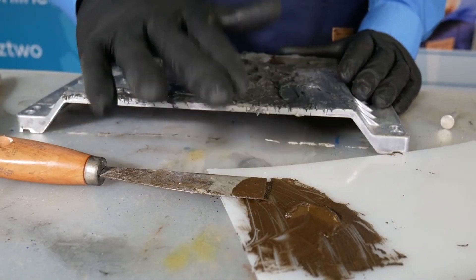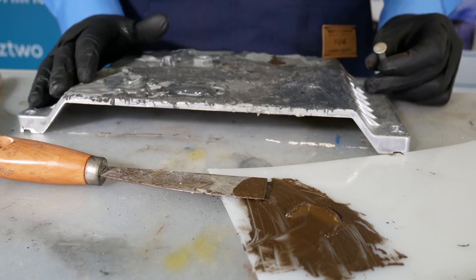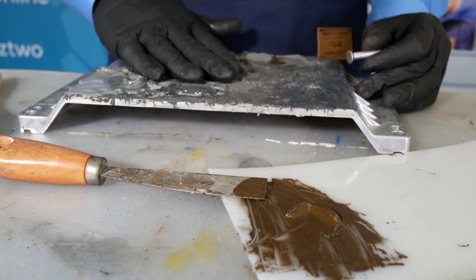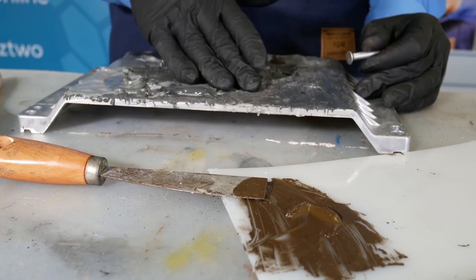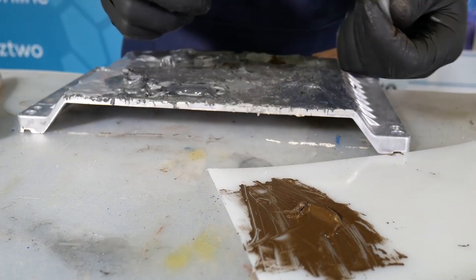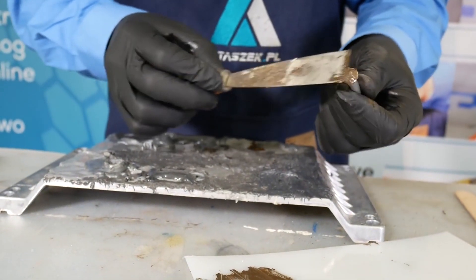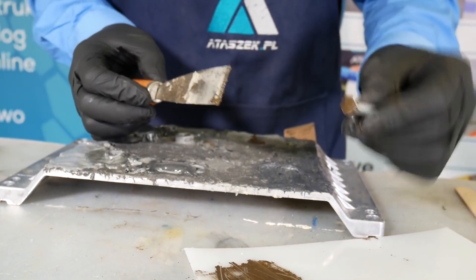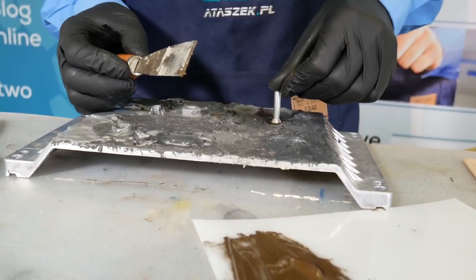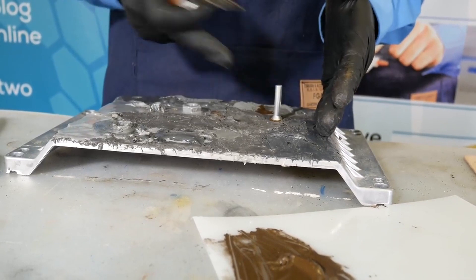There are two ways of applying this type of glue. Any of these glues may be used either to bond surfaces together or to immerse elements in the glue. If you apply the glue and then press the elements together, the advantage is that pressing will squeeze out any additional air trapped in the glue. This is the easiest method.